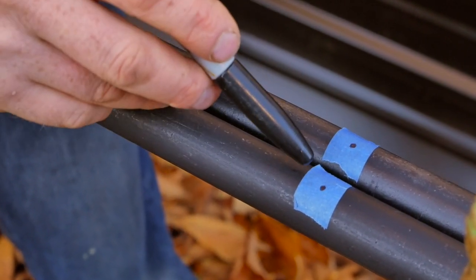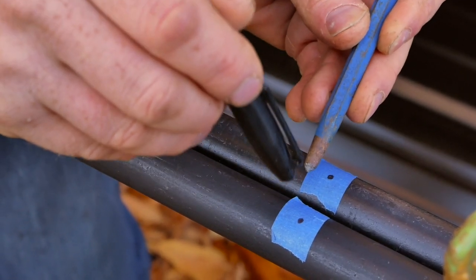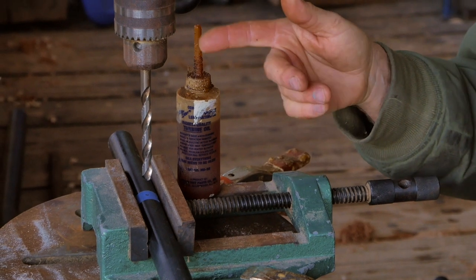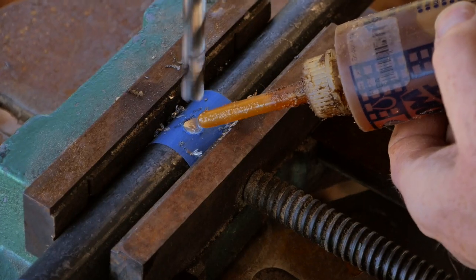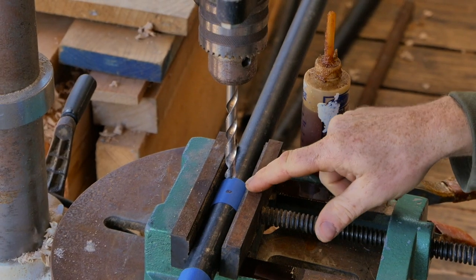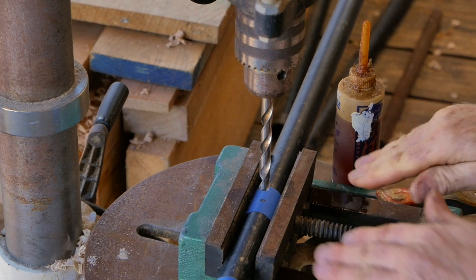I've marked out where I want to fasten the pipe to the wall. Before drilling with a drill press it's really helpful to use a punch and hit it hard to make a little dimple — that makes it a lot easier for the drill press to go straight down the middle of the pipe. Run the drill press at a medium to slow speed for cutting metal and have some cutting oil handy to keep your cut cooler and your drill bit sharper longer. Drive it nice and steady all the way through. Even after punching, do just a little bit and check because the drill bit can want to pull off to one side, so you may need to readjust the pipe.